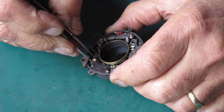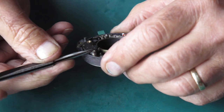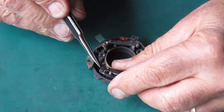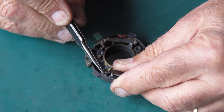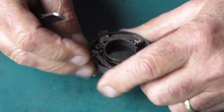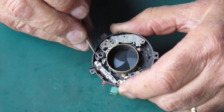The Reflex Four doesn't have a flash sync lever, so your only flash sync is the X-sync for electronic flash. Here on this lever there's a little notch — that's where that spring hooks onto. It's really awkward to get the spring seated there, but that's where it goes. I'll unhook the main spring from the main cam.